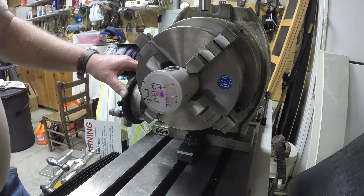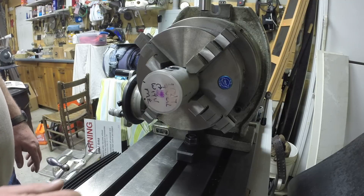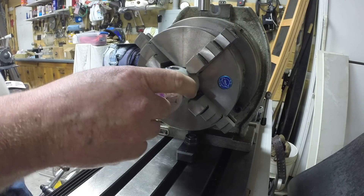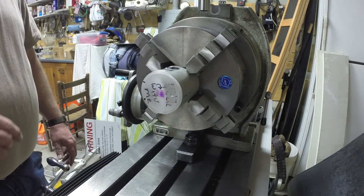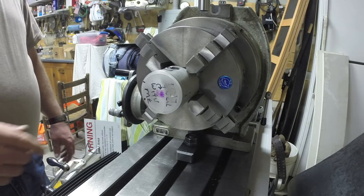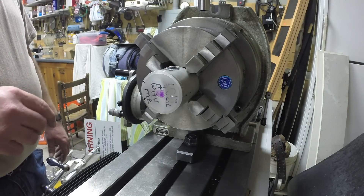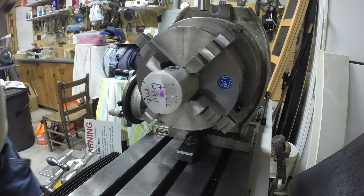I've got the piston installed on the four-jaw chuck. Right now, before I get it dialed in for the spot I'm going to be milling, I'm going to find the back edge with a half-inch edge finder, then zero out my DRO — and this is my first job using my new DRO. Once I find the edge I'll zero out the Y-axis, bring it back, touch off on the other side, hit my half-distance function, and it'll automatically tell me how far back I need to come to be dead center on the piston.